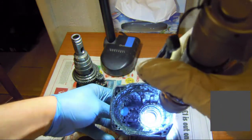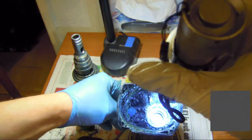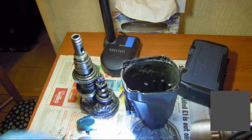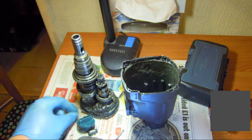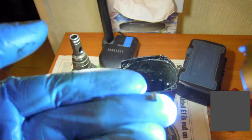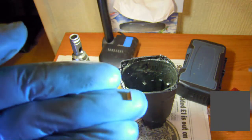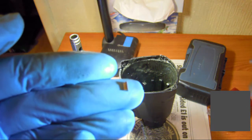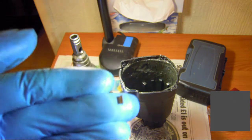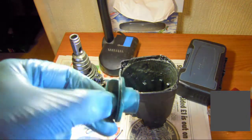This one moves like this. Only that this has to go down there completely. So basically there was some debris in the rail. It was this teeth here, this tooth. This is a tooth from a gear. And it was stuck in the rail, so that part wasn't going completely down. So when you turn this knob here, it will get stuck.